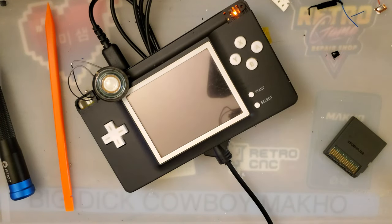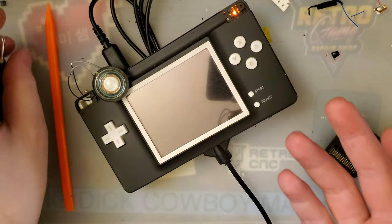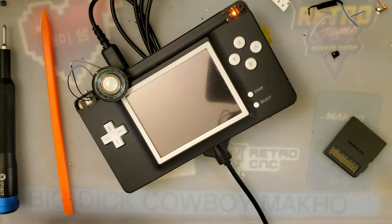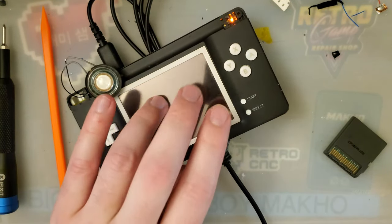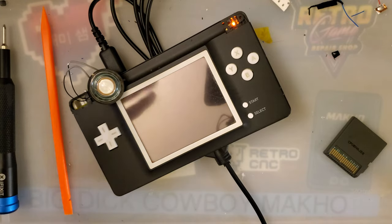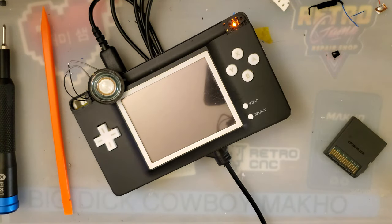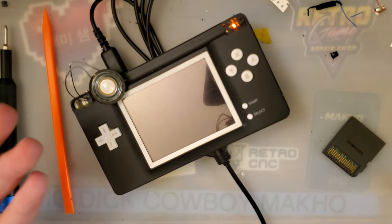All right. So let's... I think I've already started mentioning most of this before, but I'm going to go over this again. This was the DS Lite TV outboard from Rhotronix, and I'm really digging it. The install is a little bit complicated. First, you have to get the software set up on the DS Lite, and that is one of the prerequisites for getting the TV out functionality working. It means you no longer will have a top screen that works. There's no easy way to toggle back and forth as of this moment. I don't know if that's in the game plan.